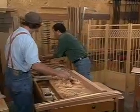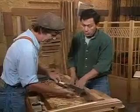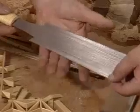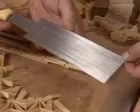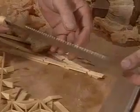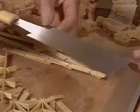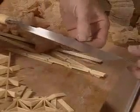Well, here we have two different types of saw. This is a Ryoba style. It's got ripped teeth on one edge and cross-cut teeth on the other edge, and the saw is scraped hollow in the middle, and the set on the teeth on both sides is exactly the same, so that this could cut as deep as you needed to in either direction, and you would bypass the teeth on the other side without the teeth marking your material.